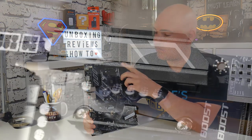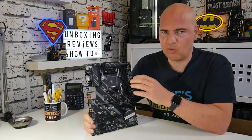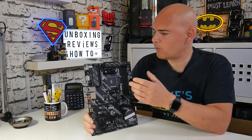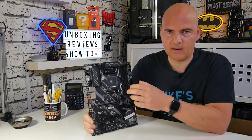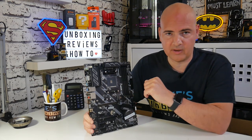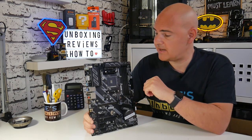Moving further across, there's the heatsink at the top, which matches up nicely with the heatsink on the other side. This is part of the problem with this board — the heatsink is quite large and weighty but unfortunately doesn't have any real vents, so the surface area is limited and it's not particularly great for cooling. This is something I'll be addressing in future videos, so click subscribe and the notification bell if you want to see how that goes.